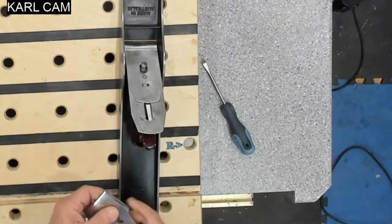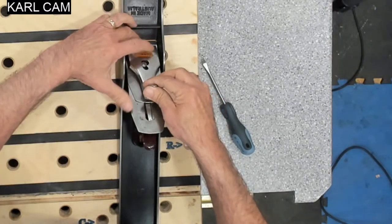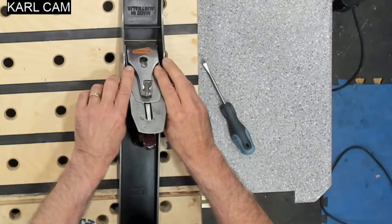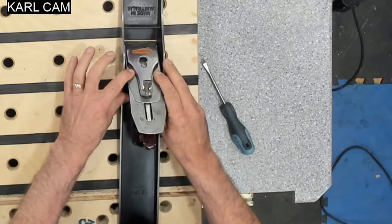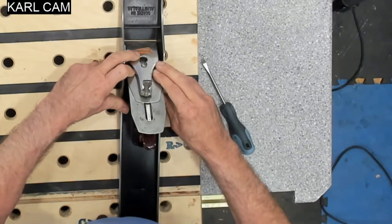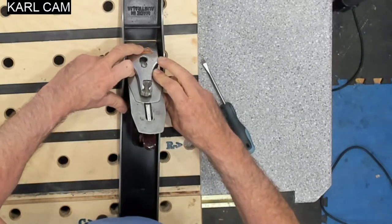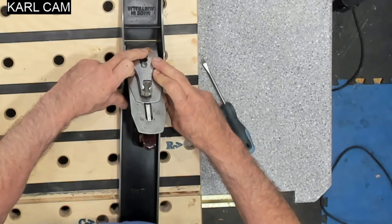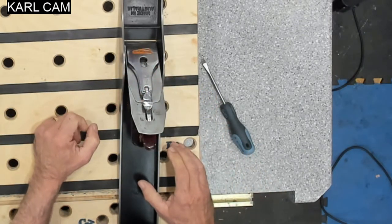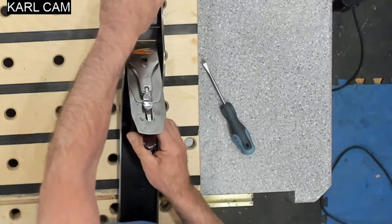And then the lever cap, in it goes. And then make sure, when you put it in, I pull it back as well. Don't push down on the blade. There is a little bit of movement there. So I pull it in and I make sure that the lever cap is in the middle and then straight back. That's locked. Next thing to do is to sight it.